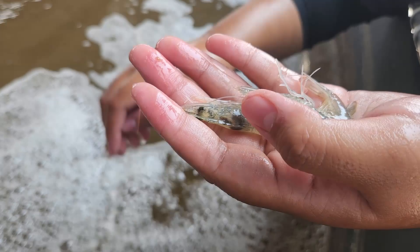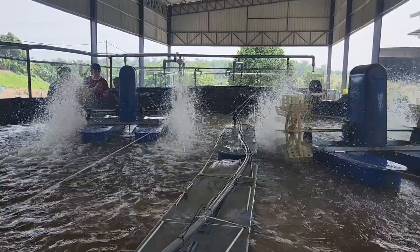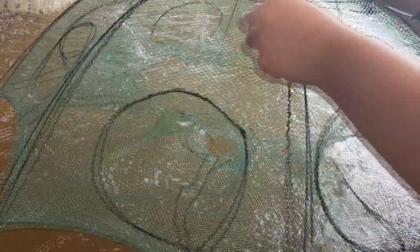The paddle wheels are installed in a way that promotes mixing and agitation of the liquid, as you can see here. Initially we were a bit worried that if we switched over to a paddle wheel aerator, the aeration would only be at the surface of the tank and we might encounter dead zones at the bottom. We have actually gone in and verified this, and we do not have any settlement at the tank. Most of our shrimps are very healthy and we do not see them feeding on sludge or having issues with Vibrio, which is common in ponds that have a lot of debris at the bottom.